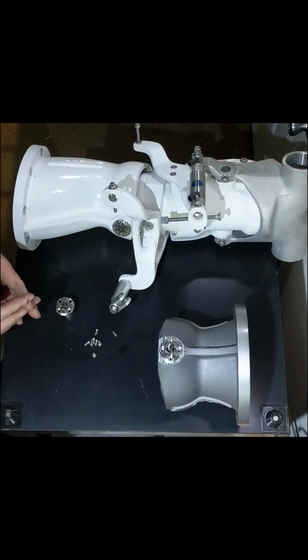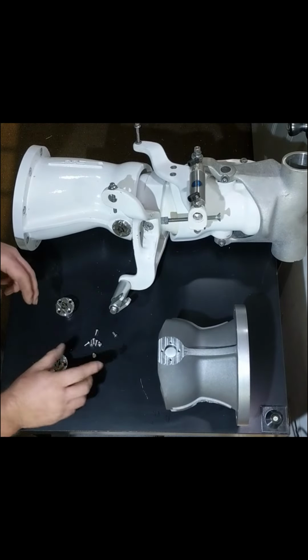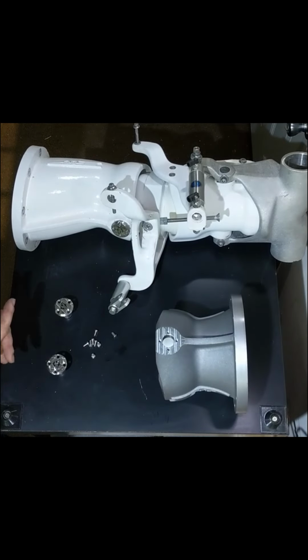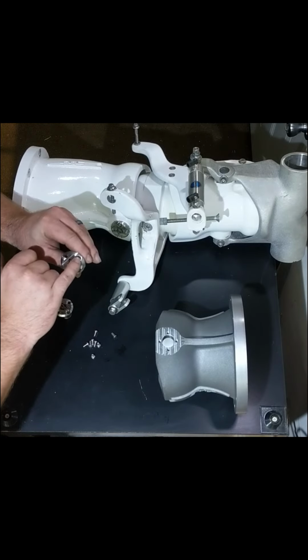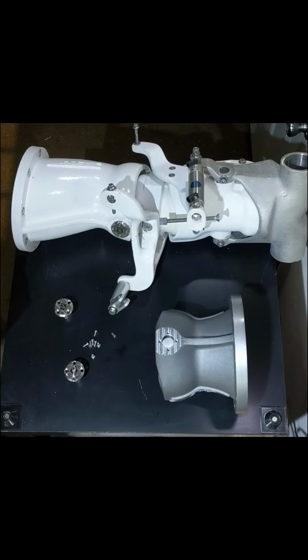So we sell not only the pins, we also offer as a service the machining to do this. We'll machine both sides, obviously. And then we also offer a kit which gives you all the drills and taps you need to be able to perform this. They'll give you the drill that is just slightly smaller than this minor diameter.